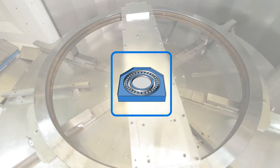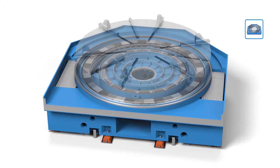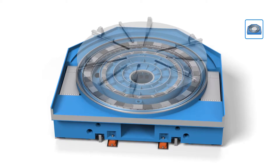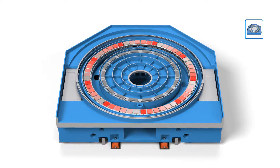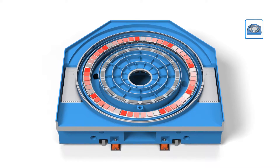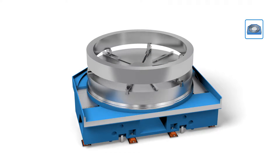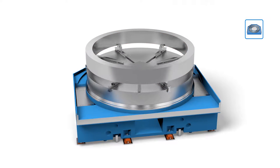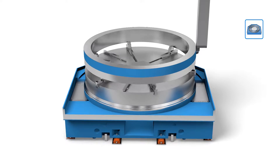The newly developed and patented round table drive, Segment Direct Drive, is based on linear motor technology and consists of several circularly arranged motor segments. The electronically controlled primary elements are mounted on the table foundation and are actively cooled. The secondary motor segments are mounted to the round table as permanent magnets. This drive performs exceptionally for turning operations and has by far the highest dynamics, accuracy, and lowest noise emission compared to conventional concepts.